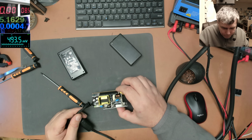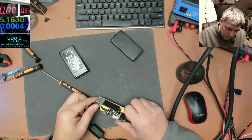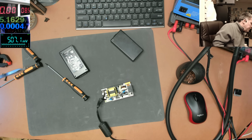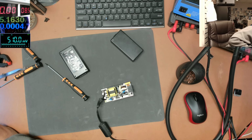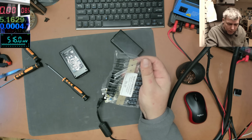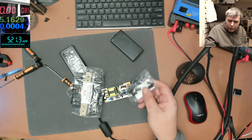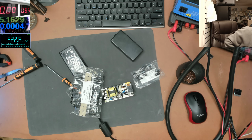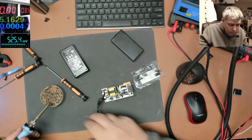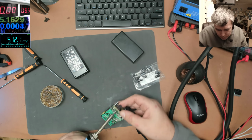A nice switching power supply. The capacitors are the value 16 volts, 470 micro. Let me find something here. Let me try and find something. Okay, these are too big. 470, 25 volts, which is fantastic. Okay, let's do it quickly. So minus, it's on that side.